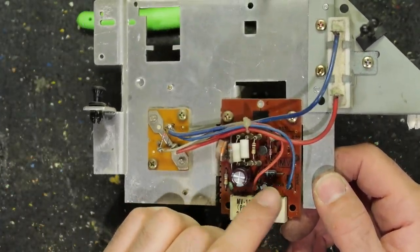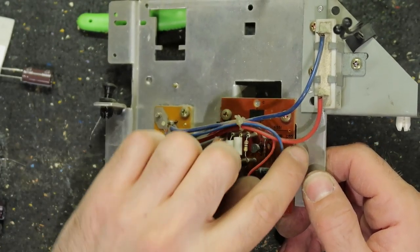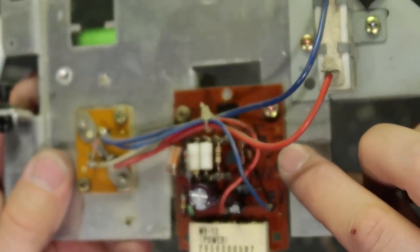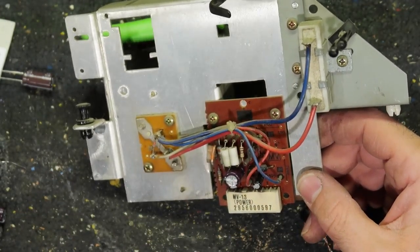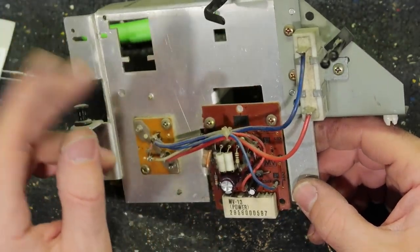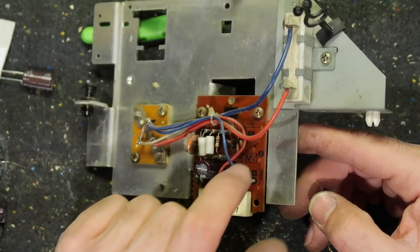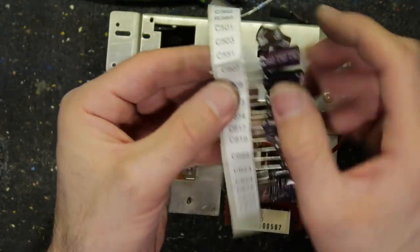Now this is interesting — the next cap is C551, which goes right there, but there is nothing there — it was never installed. Do you put one in? I think I'll just leave it out, but I'll ask Ian what's up with that one. It's a little confusing. On the other board where I didn't put in the cap, there was no spot for it — this is the same board with a slot but no cap in it. So I'm going to skip that one. Now we go to the sixes — this is C607, so this board's done.